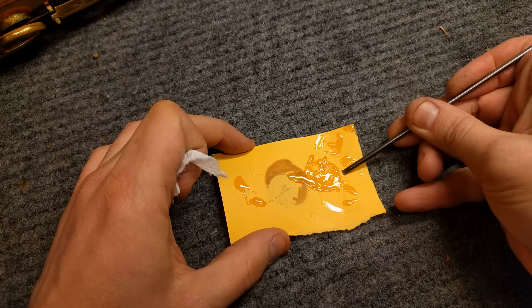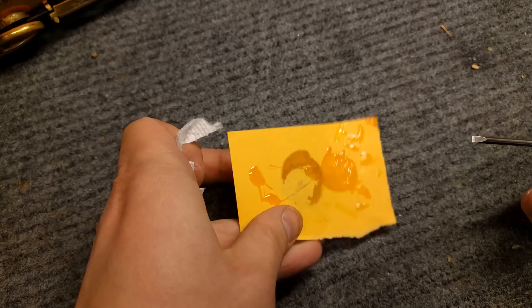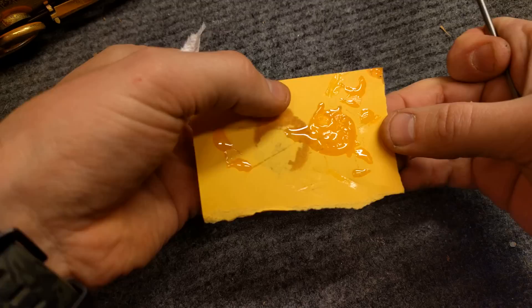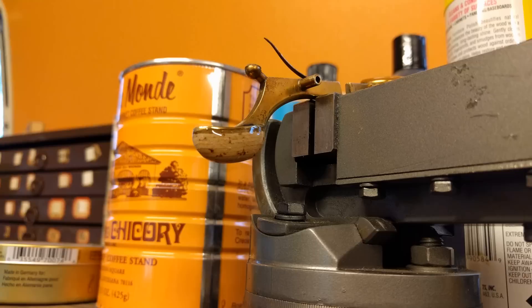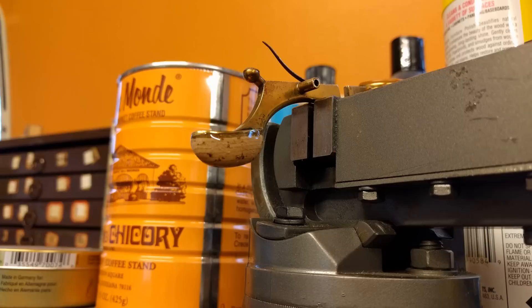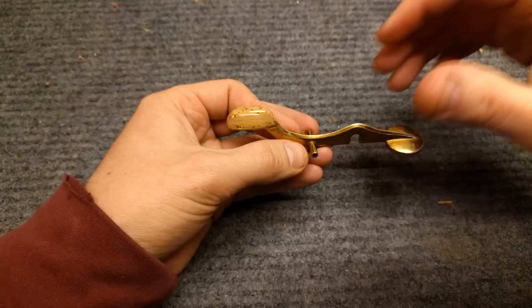It's flipped and curing now. We can see here that I've got it lightly mounted in a smooth-jawed vise. I'll flip this a couple times and just let it sort of flow up and down, and it'll be nice and even by the time it finishes. You'll get a feel for how much time you can leave it after you do this once or twice, because at a certain point, if you've got a big blob and you turn it around, it's going to be dried and not actually move anymore. At this point it has pretty much stopped moving. I will usually allow it to finish its drying upside down because that just helps smooth out the overall contour — if you do the final cure right side up, sometimes you can get ridges along the edge, but if you do it this way, it'll end up nice and smooth.